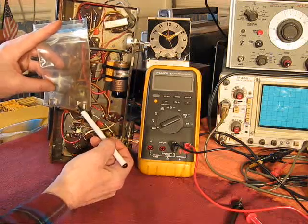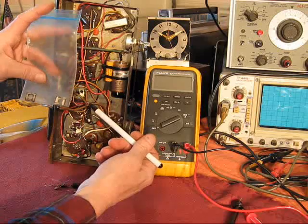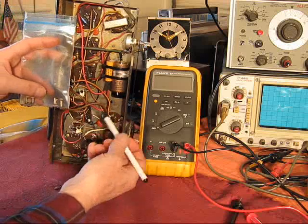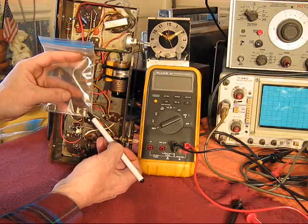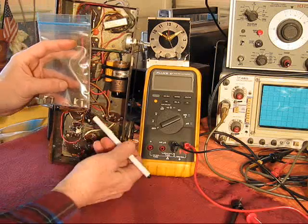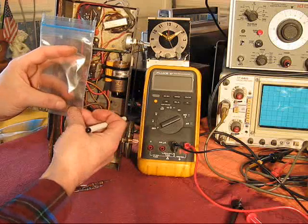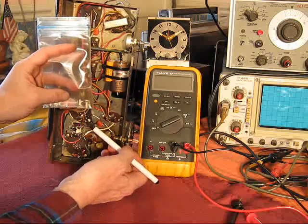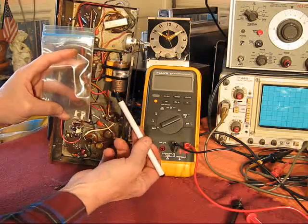There's nothing soldered to this or bonded to it. It's just clamped in there. It's like a crimp, and after all these years, it's just worn out. Temperature cycling, expansion, contraction. You probably can't see it, but on the areas where the tabs, lugs inside this can make contact with the silver deposition on here, are worn. They're worn through. Holding it up to the light, you can actually see light coming through where that contact was made. So, for different reasons, these capacitors are shot.